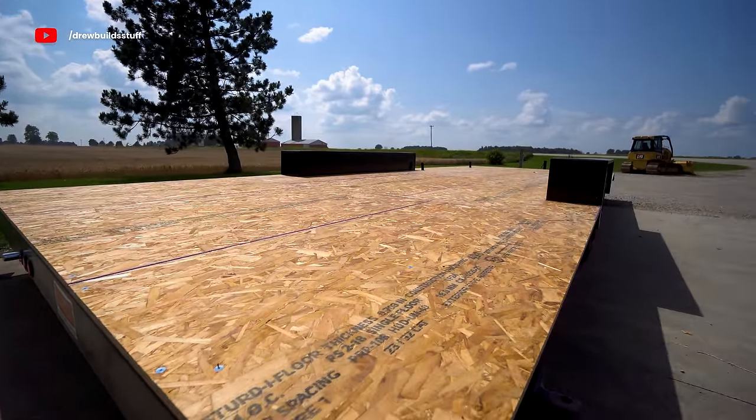Around doors or windows or anything else that interrupted a full panel, I would just take a tight measurement and then subtract about 1/4 to 3/8 of an inch depending on the temperature. This will leave a nice size gap around every obstruction and give that panel lots of room to expand still. That sill trim also gets installed along the sides of any longer vertical cutouts like the sides of the windows.